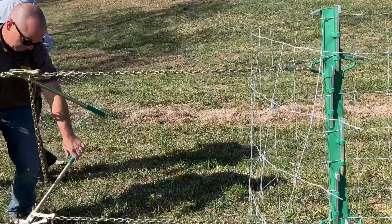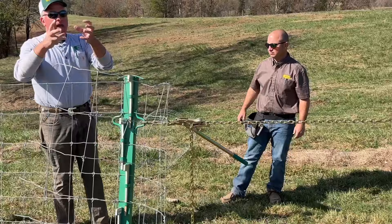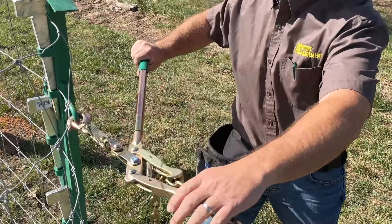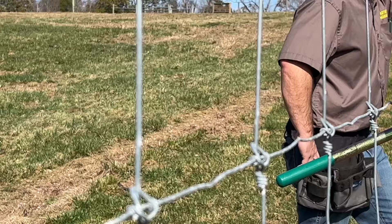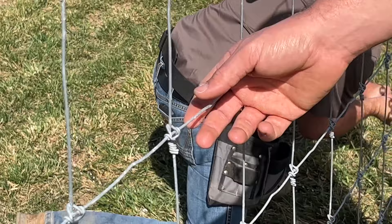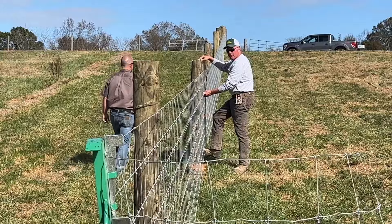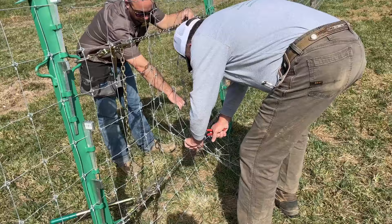Before we get all carried away, let's let it sit here. Me and Michael are going to ride down and look at the corner to see how it's making up around the corner. We're talking about the tension curve. This one is already under tension, and we want to make sure we don't pull out more than 50% of the curve. If we over-tension the wire, we're going to put too much stress on it — this high tensile wire is not made to be overstretched. There are two reasons we don't want to over-tension: first, when the weather changes, we want the wire to expand and contract. Second, when the fence comes under pressure, the tension provides a shock absorber to prevent your fence from failing.